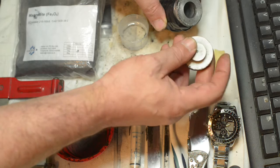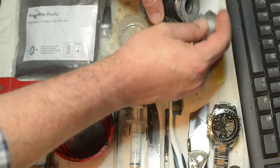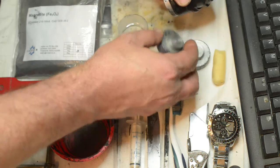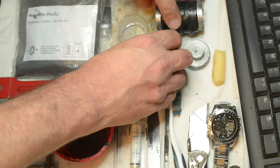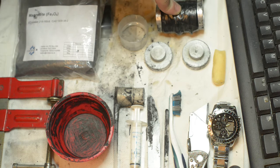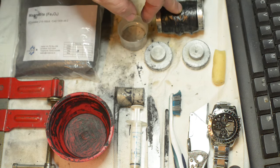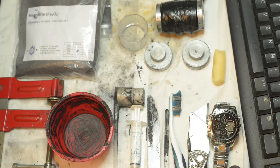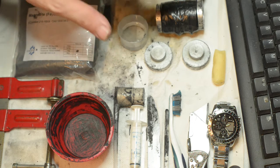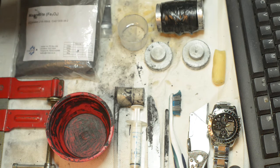There is a difference between the diameter shown here on each end cap and that of the internal diameter of the main mold body. The whole point behind that small difference, 0.5 millimeters, is to allow for a gap to exist, and that is used as an avenue of escape for the contents of the mold once a given temperature and pressure have been reached. Beyond that point, the viscosity of the contents of the mold is such that no further evacuation is possible. Up to that point, the viscosity of the contents of the mold changes with temperature and pressure.